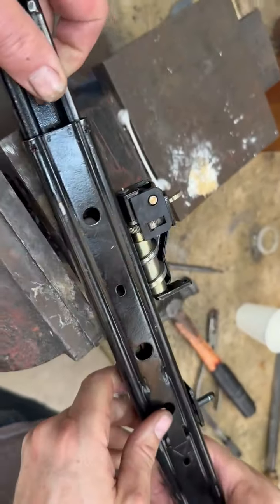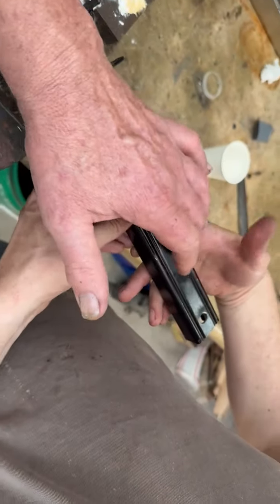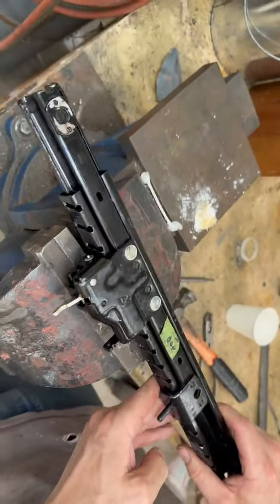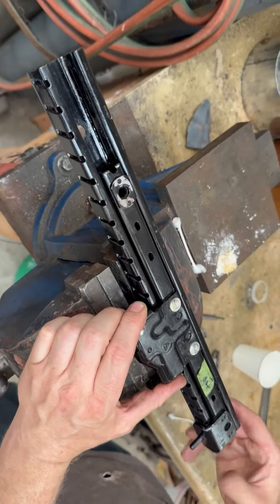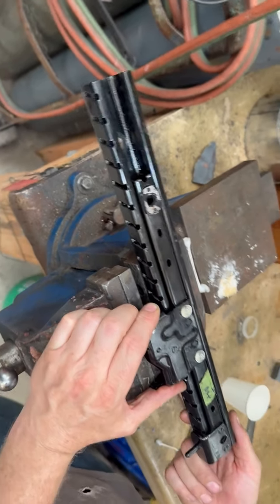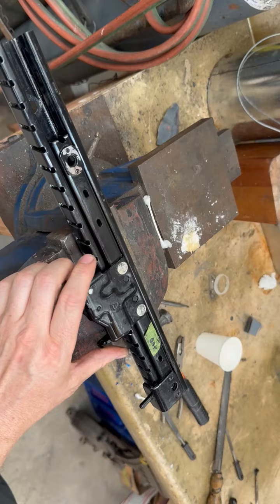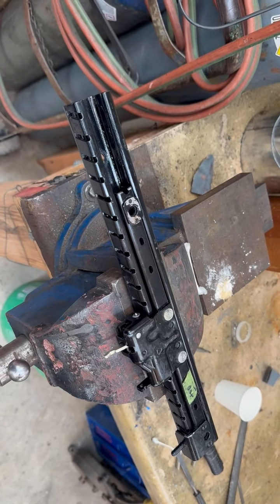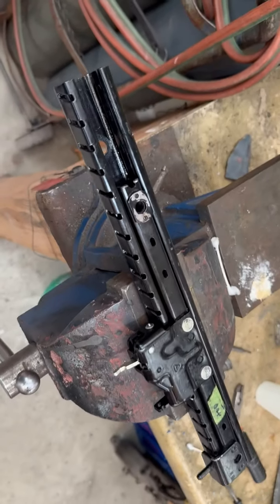Now the weight of the passenger actually rides on only four balls. They're a six millimeter diameter ball, and certainly with that amount of pressure it's going to want to press into the steel, not unlike a center punch on a piece of steel. However, it is designed to use one ball at each end, and that is what we have put back in it. We could take it apart and put more balls in there, but that will limit its total travel by six millimeters in either direction.